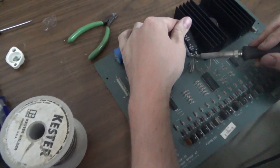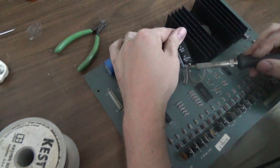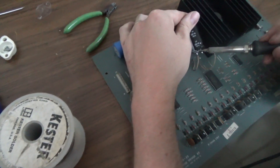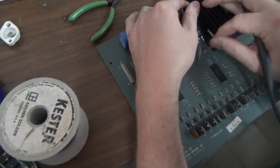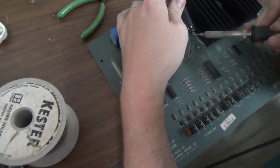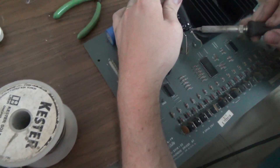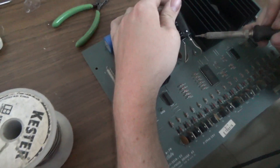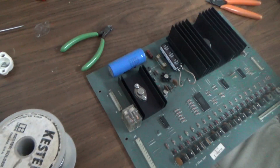We're putting a 15,000µF 35-volt cap in there. You don't necessarily have to increase it — the reason we're replacing it is because the other cap's just so old. And since it's a filter capacitor, it's going to give you trouble. Joe's carefully soldering the wires back on. It's really not rocket science here, folks. Now we'll put some zip ties on it to hold that sucker in place.